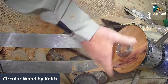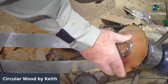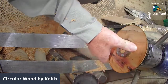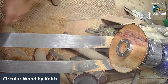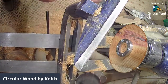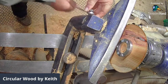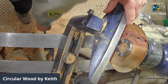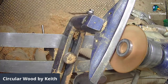No, no. And my usual trick is just to get it to pinch on the jaws, twist it. If you've got wax in there, you've got sanding sealer in the mortise, that will just clean it out with the jaws before you finally tweak it up, and we're good to go. I suppose this is the time-consuming piece for me, turning everything, getting the spanner on and doing it that way, but it's not a major issue. I'm quite happy with it. I should run with it for the time being.